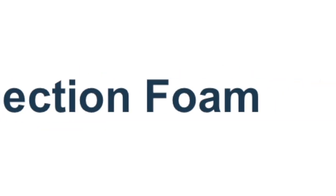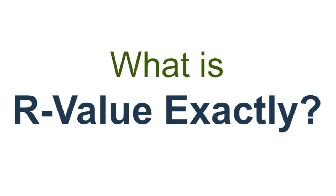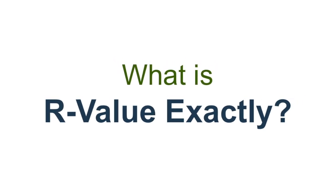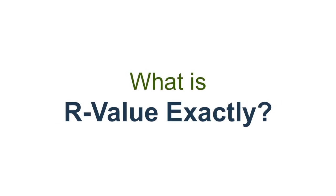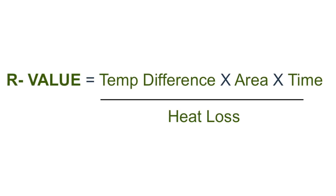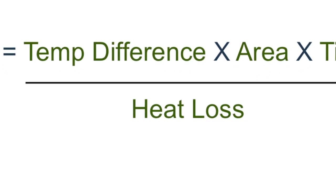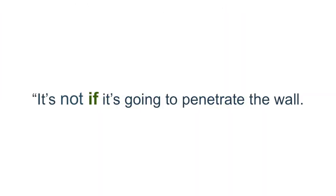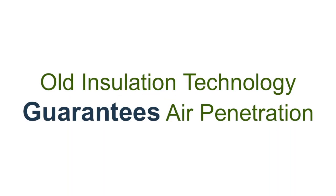With my material, I have never had anybody complain about not seeing a 40% decrease in their utility bill. Heat on the exterior of the house enters the wall and the insulation loads up to 100%. Once it's at 100% heat load, it allows hot air to enter the home. So if you have R13 in the walls versus R30, it's going to take a lot longer for heat to penetrate at R30 than at R13. It's not a matter of if it's going to penetrate the wall — it's a matter of when. It just prolongs the time.